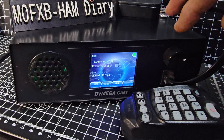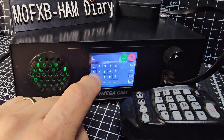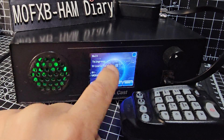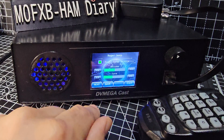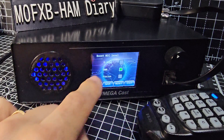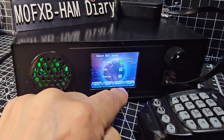You can control it using the touchscreen — turn the volume down here, there's a quick power off button here as well. If we just tap the screen, at the moment we are connected to talk group 91; just type it in and push the tick and it sets you up ready for talk group 91. To enable other modes, go to Menu, then System, then Next. You can set volume and tone, go Next again, and here I've chosen DMR, but you can choose DMR, D-Star, and Fusion. I'm going to untick DMR and go to D-Star, then Save.